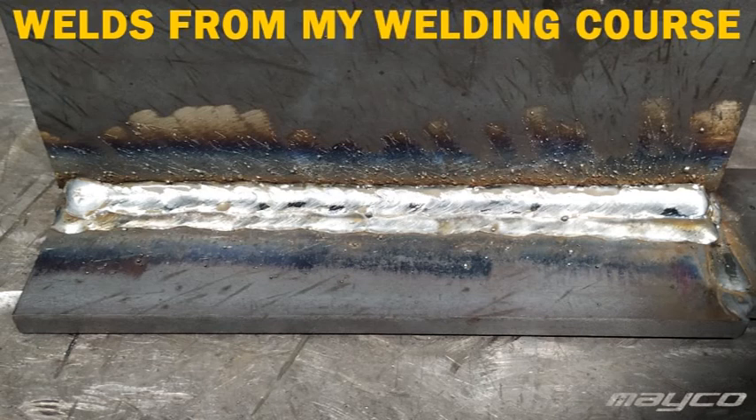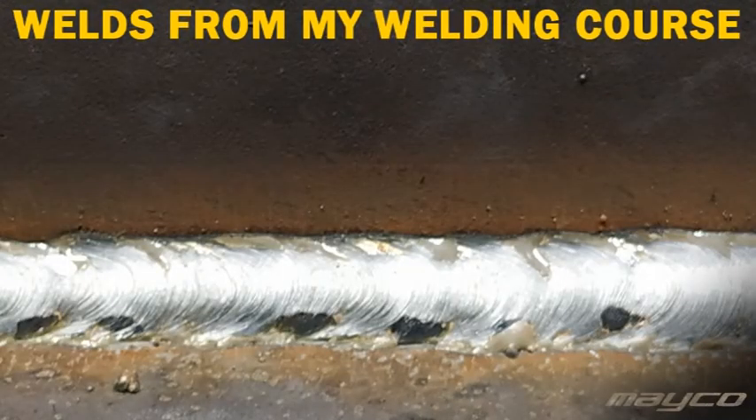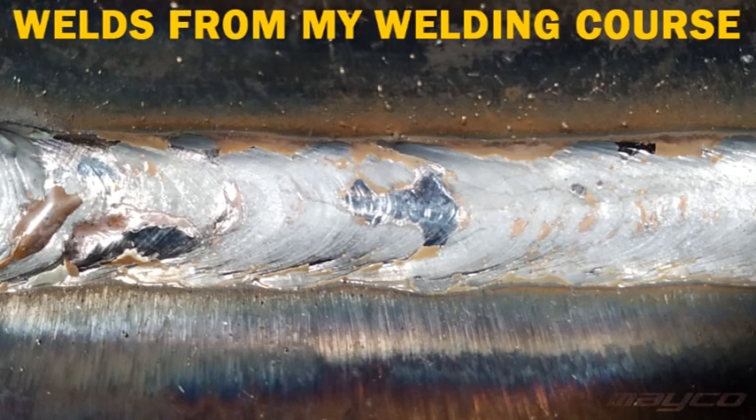Another thing is automatic wire feed: you use that if you put a new spool on, and normally you would feed the wire in using the torch — but that also releases gas. So there's a button to feed the wire in using the electric motor instead, so you don't waste gas. Most machines have that.